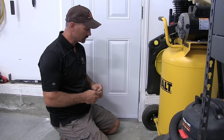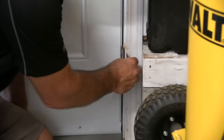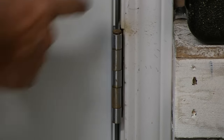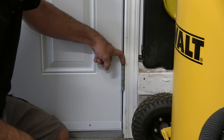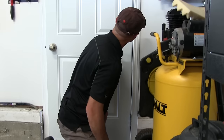So we want to loosen off all the hinges, or in this case we did. You may not need to depending on the situation — maybe you've got an uneven gap and you're trying to shim just the bottom or top hinge. But in our case we're adjusting all the hinges pretty equally. I've got my cardboard and I've already put it in the ones up above. You just want to slip it in there, back flush or just a little bit further back than the edge of the jamb itself. You don't want it too far back, because you're using that cardboard to pivot the hinge and move its pivot point, which should shift the door and help all the problems we're having.